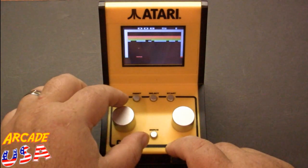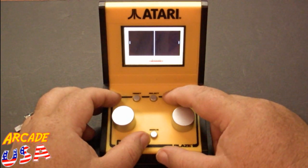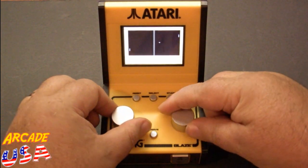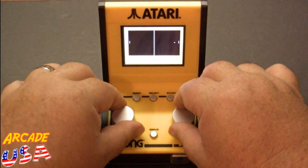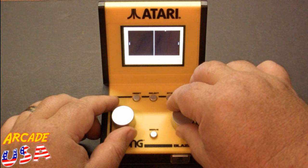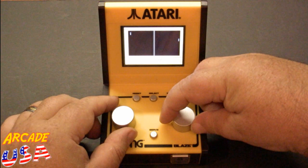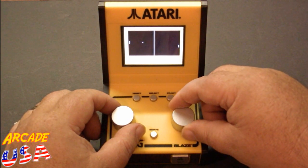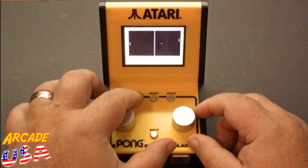Let's check out pong real quick. I'll put it on two players — watch how much more movement I get. The mechanical encoder just kind of blips and bleeps around; you have to turn it multiple times at a certain speed to get it to respond. Whereas with this one I can go really slow and make fine movements. The mechanical one will occasionally skip or stop. Here's a quarter turn on the mechanical side versus a quarter turn on this one — big difference, made it a lot more responsive.